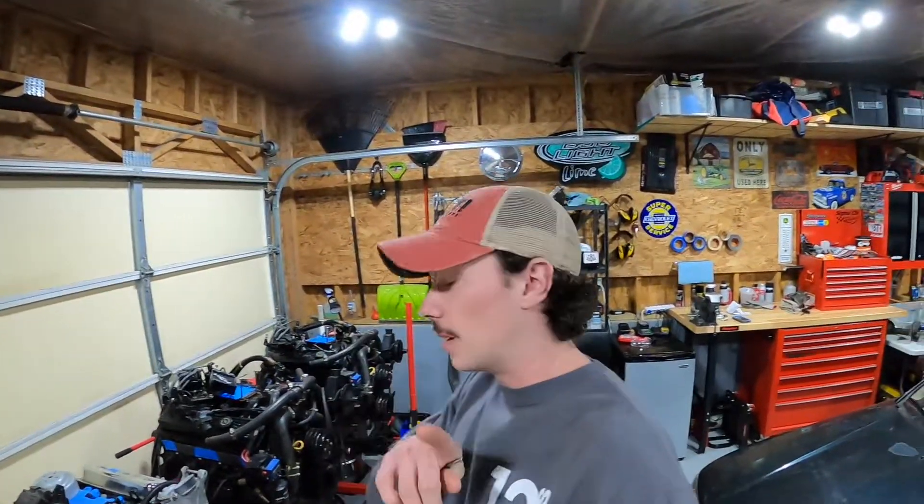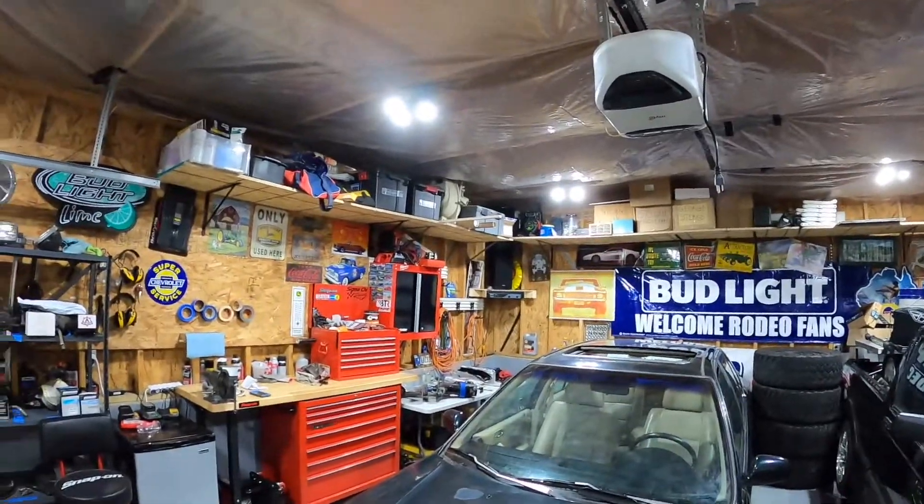That right there is a 1987 Formula 242 SR1 — only made for one or two model years, and it's one of like 30 boats. Super cool. These are the engines in it — small block Chevys, 350 cubic inches, 5.7 liters, 270 horsepower apiece, V8s, American-made by Mercury, paired to Alpha drives — counter-rotating Alpha drives sitting over there.